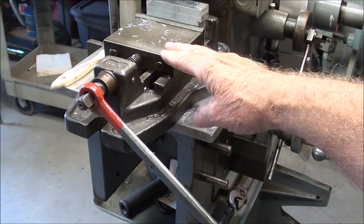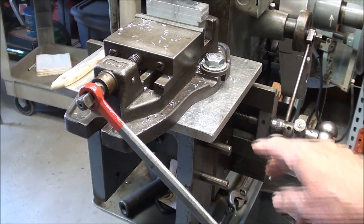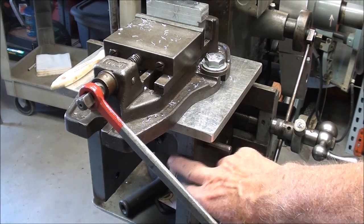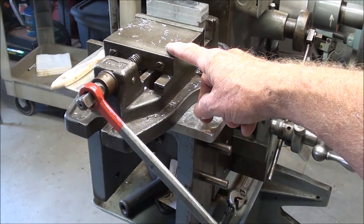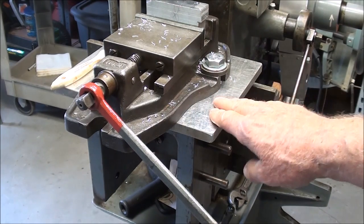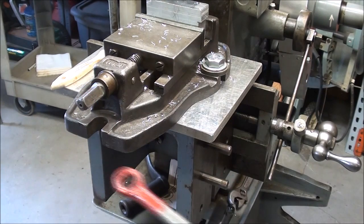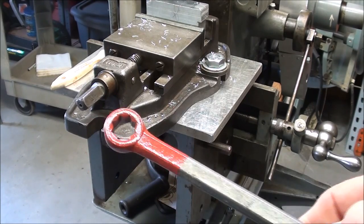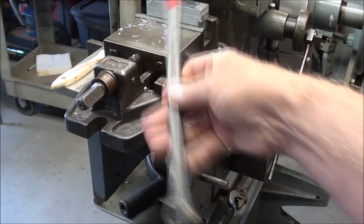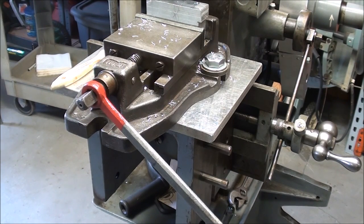This machine did not come with a vise, so I put my number 21 Brown and Sharpe vise on there — a little 4-inch vise. To mount it, I put one of those ground aluminum plates on top of the machine, held down with T-bolts, and then the vise in turn held down with 5/8ths fine bolts onto the aluminum plate, so I didn't alter the machine in any way. In my tool drawer I found an 8-point wrench that fits perfectly on the half-inch end. It's longer than what I need, but I've got so much leverage with it I'll never need to hit it with a lead hammer. I've been taking some sample cuts here, just for the fun of it.